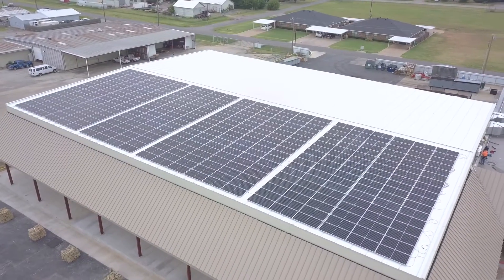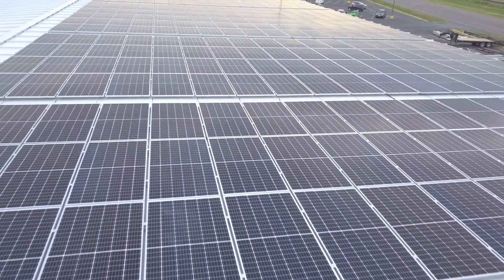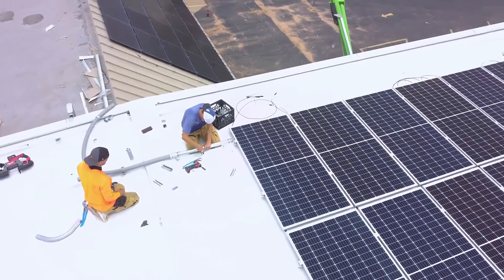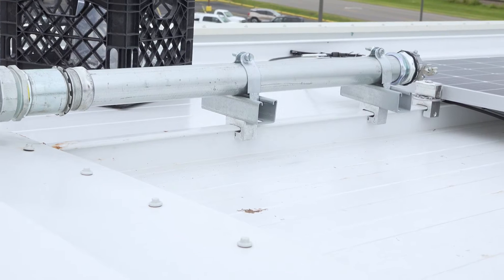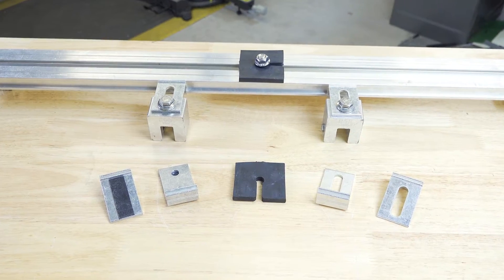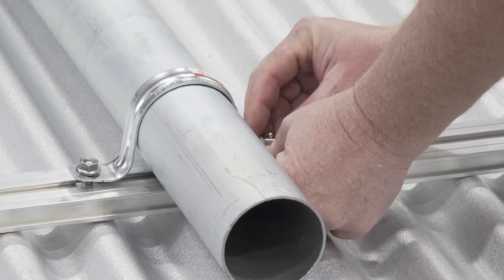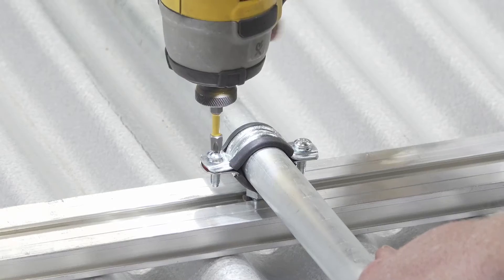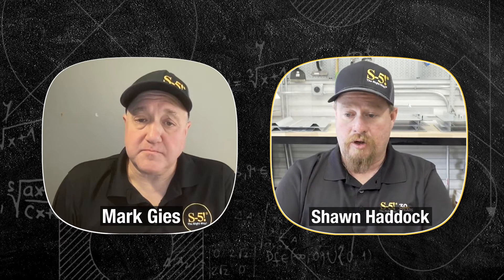This is the finished system. It's a good looking system when it's in place. Now you'll see the home run — it's the same clamps. We provide clamps that can be used to mount any part, balance the system, your home runs. We have a product called the Gripper Fix, which lays conduit on and bolts conduit on using our same T-clamp. In addition to that, we now have the Conduit Clamp, and we've come up with a system where you can mount on top of or under the Gripper Fix — you can even shoot conduit underneath those modules to hide your conduit. It's a really slick system.